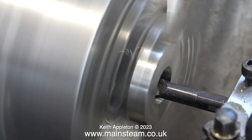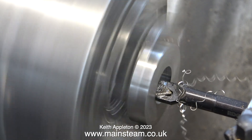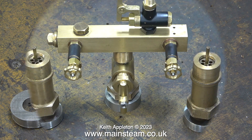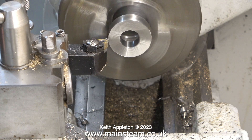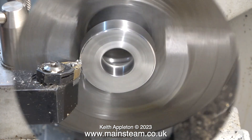I'm going to bore the holes in the center of all three blanks, and then the next part of the machining operation will take place in the Boxford lathe. Here are the three blanks, approximately the same size, sat on the bench. When I sit the safety valves and the turret into the blanks you should now be getting the idea of what I'm making. I will eventually turn down these three blanks to become three stepped washers.